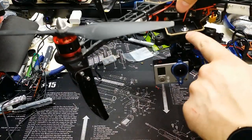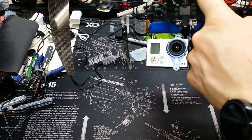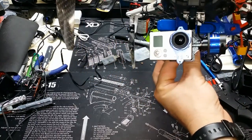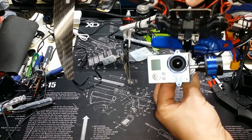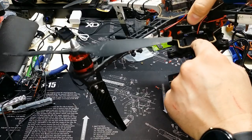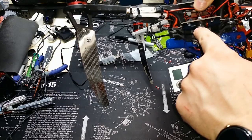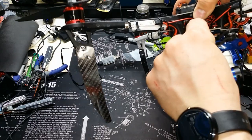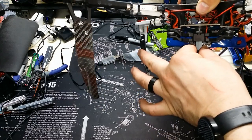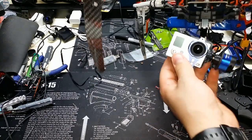For the install, I basically just drilled — there are 2 points you have to install this bottom plate. This top plate actually floats on top of these compression fittings here, and you can see the movement if I wiggle it. I used 2 holes here and right inside, using some really small screws and a few nylon compression washers. I compressed those and it's nice and stable, but most importantly it doesn't hinder the movement at all of this anti-vibration dampening plate here.